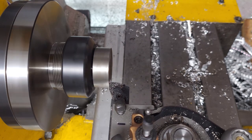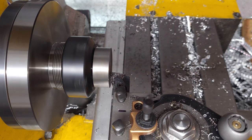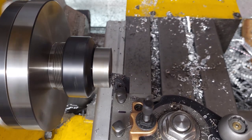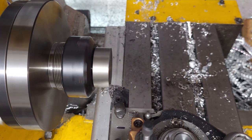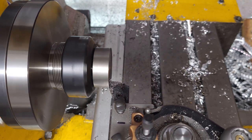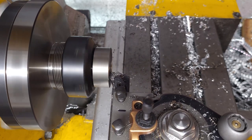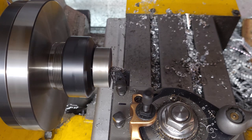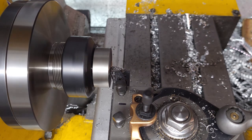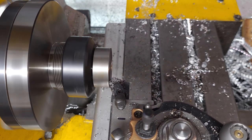Now we have it flipped around and mounted in the ER40 collet chuck. I only have 1/8-inch increments on my ER40 because I'm cheap — it's just for holding standard diameter stock, so I don't have the full ring set. I couldn't use 20mm, which is the biggest ER32, so I'm going with 19, which is equivalent to 3/4 inch. I have metric ER32s and imperial ER40s — because America.